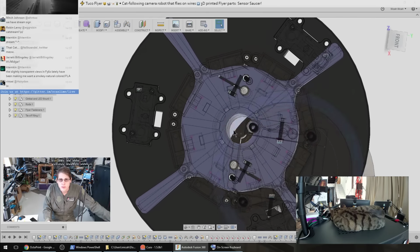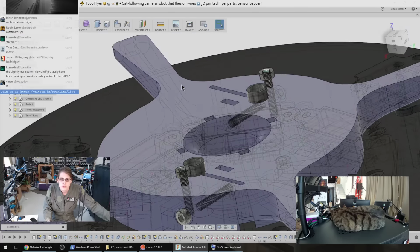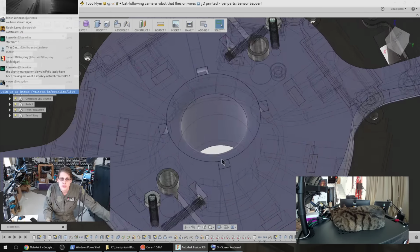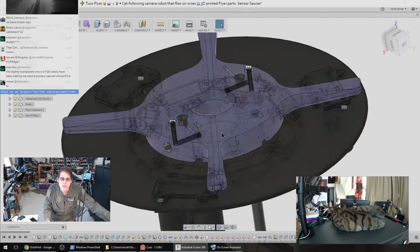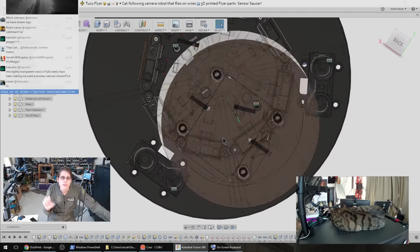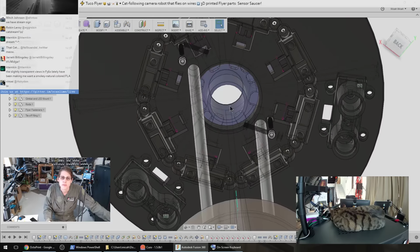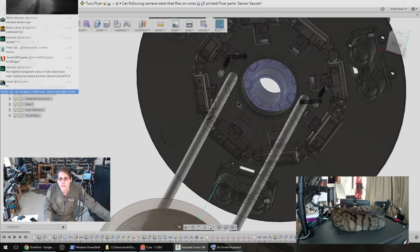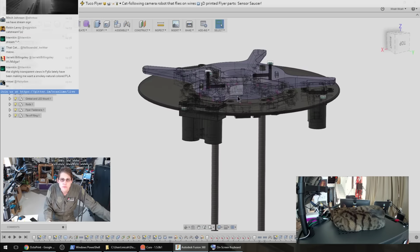And then this is where the tether for the robot goes through. There's room for, I forget what the actual measurement is, but I think it's like 1/2 inch diameter, maybe 3/4 inch diameter, kind of crinkly convoluted tubing that covers a few wires that we'll need. There's some speaker cable for 12 volts DC, there's a coax for video, and there's Ethernet. And so that goes right through down the middle.